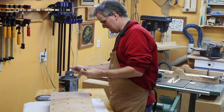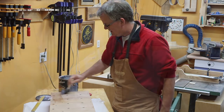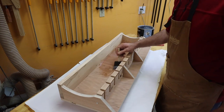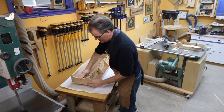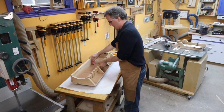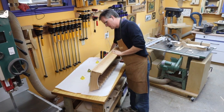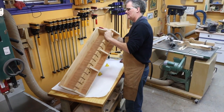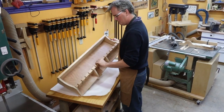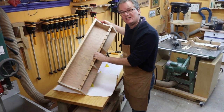As much as I'd like to get it hung up right now, I'm going to pause and put on a couple of coats of water-based poly. Two coats of finish are plenty of protection — just give it a light touch with 220-grit to take down any rough spots — but I think it needs a little something else.